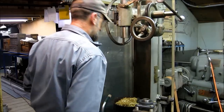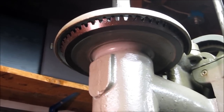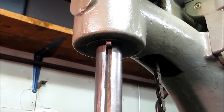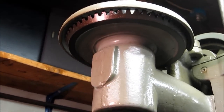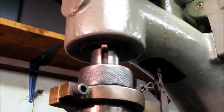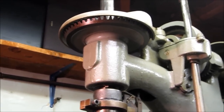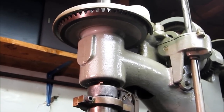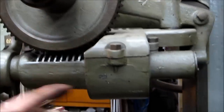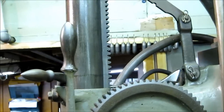Let's take a look at spinning and driving. The bar slides through this bevel gear, which gives it its freedom. The key is shaped so that it overhangs the top and bottom of the bevel gear, so the bevel gear is just doing a rotational motion. Whether you had a key in your shaft long enough to make your travel, you could have a pulley for electric drive, chain drive, or a hydraulic sprocket — anything to rotate there. You could easily have a keyed bore and rotate your shaft. This has a feed through the gear train — we had four speeds but used just the slowest, which gave us a real nice finished cut. That drove the rack gear.